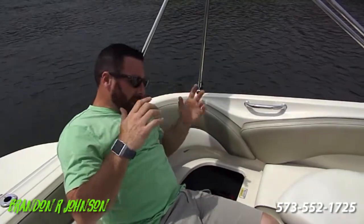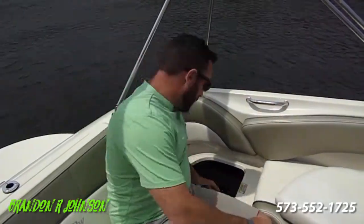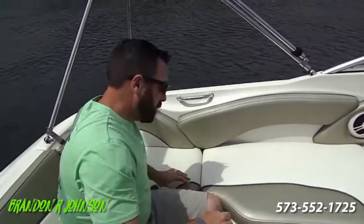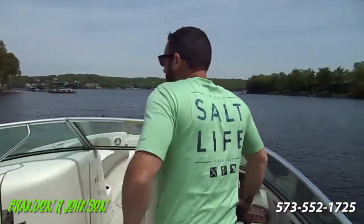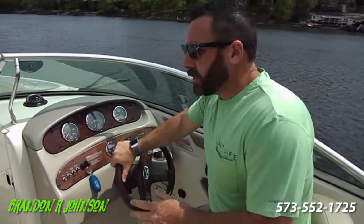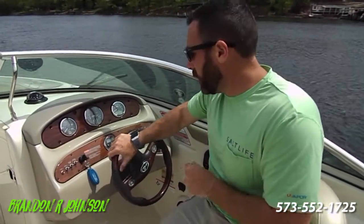Coming up to the helm. I'm going to include a link in the description covering the three things to do if your boat won't start. If you get a dead battery click, turn the key over and nothing happens — maybe you left your battery switch on, or maybe the boat's slightly in gear. If it's in gear, it will not start. The number one reason people call me after the sale and their boats won't start is the kill switch, right here.